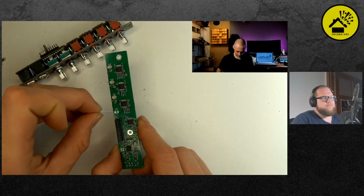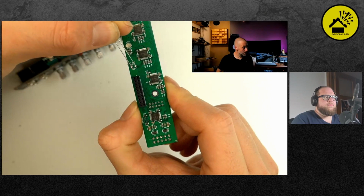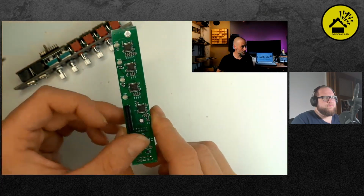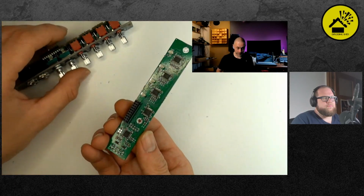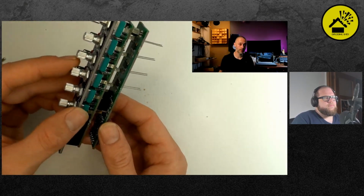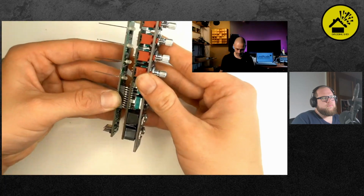Can you show it with the last one? So here's the long leg. Long goes to the square solder pad. Yeah, and then first just put it in. And then in the next step, you have to sandwich the first 2 layers together. And you have to take care that the LEDs don't fall out. And then maybe...